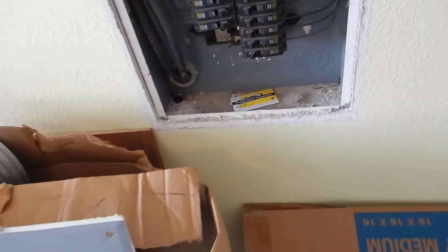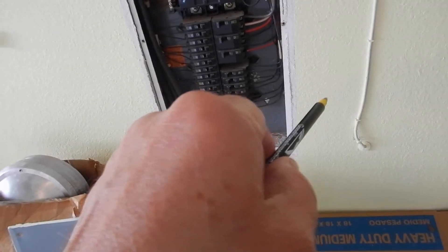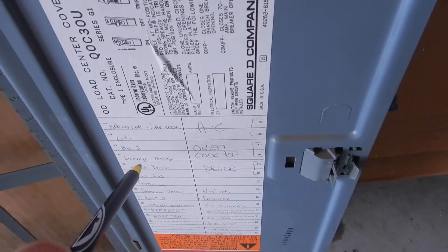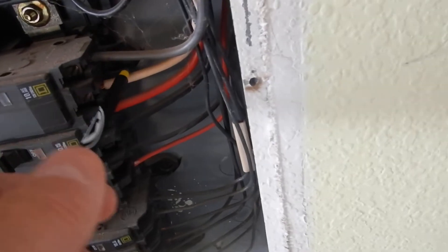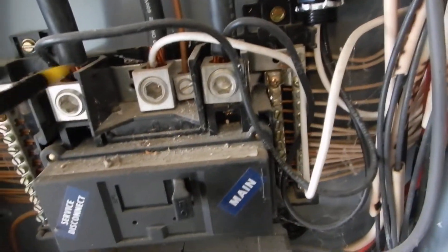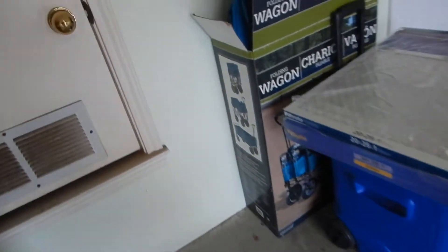It's a 150-amp box, copper to copper. So what did we learn? Our grounding rod is not properly buried, our meter is not properly sealed, our cabinet was improperly screwed into place, breaker labels are handwritten instead of printed, the AC circuit is over-fused, we've got white hots, double-lugged neutrals, the surge protector was improperly installed and double-lugged, no neoprene covers, the neutral is not wrapped with white tape, and there's a bonding location that needs to be found.